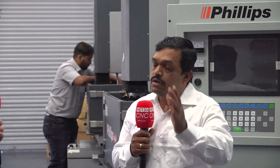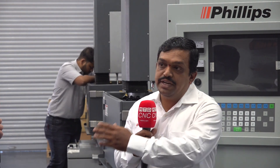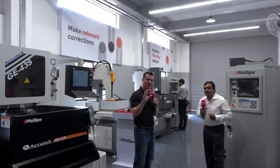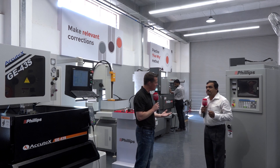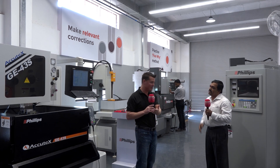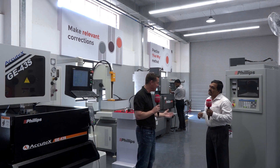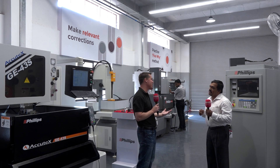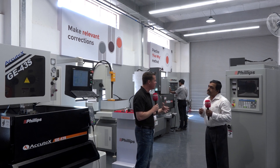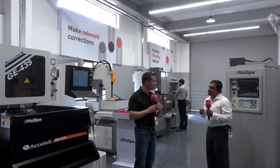There are different types of machines, like ZNC EDM and CNC EDM, fast wire EDM, or normal wire EDMs, and even EDM drill to finish the process. When I think of EDM, I think of the ability to set something down and walk away from it — come back an hour later, a day later, a month later, or however long that project takes. It allows us to run unmanned, so we can get a lot of products done while running other machines.